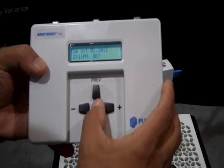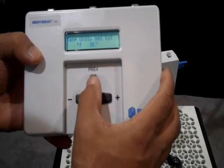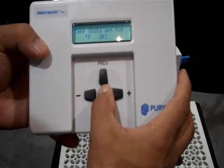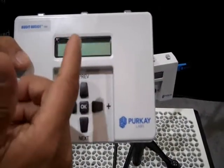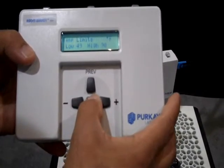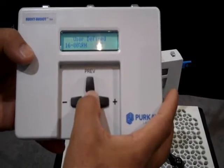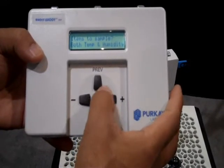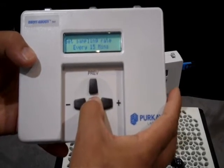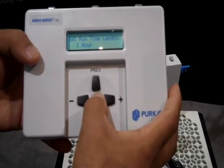I'm just going to do a scan — this is a long scan. I'm going to set the set points: temperature units, and then you can set the limits for what you want for the trend data — ASHRAE limits or user-defined limits. Here we have set it as 49 degrees as low and 90 as high, likewise for humidity. Then you press the button to set how often you want to sample, what the caution bands are, and how long you want the run to go.